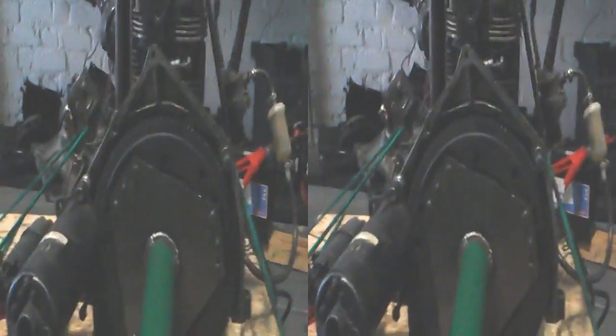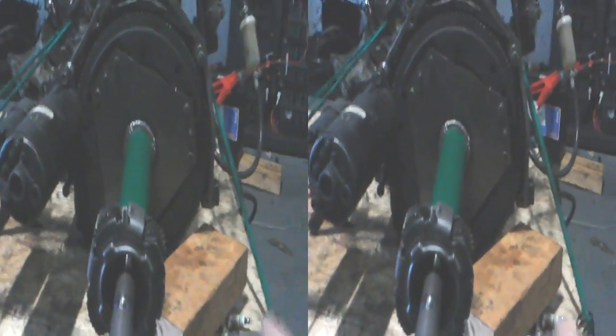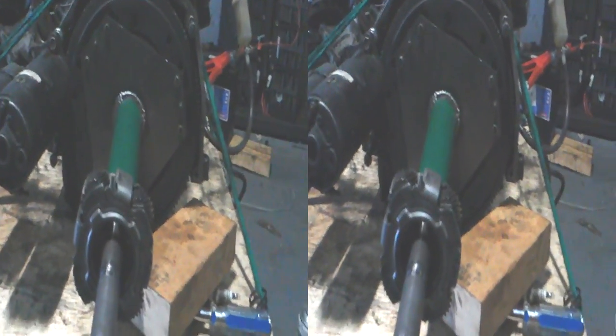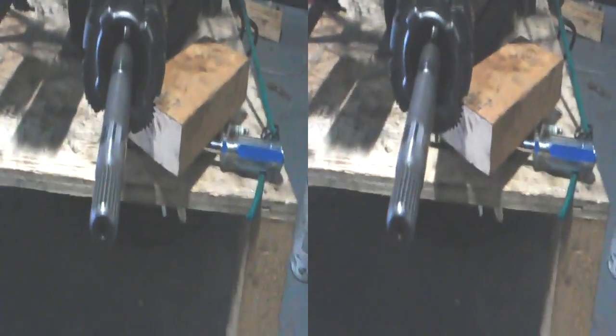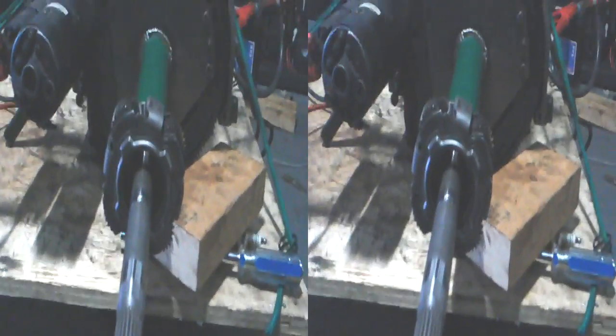So what I'm going to do is take the flywheel off, which is only held on by six bolts. And if I can put the flywheel into the lathe head — which I might be able to do, although it's a bit big — and then true it up by bolting it onto it while it's in the lathe head. So at least I can do it without breaking things, and it's under control.